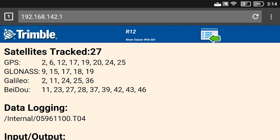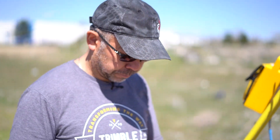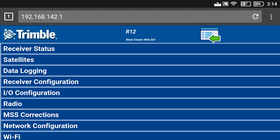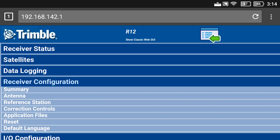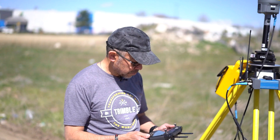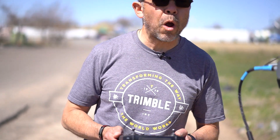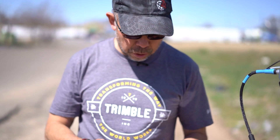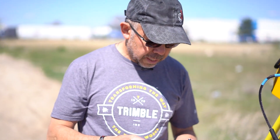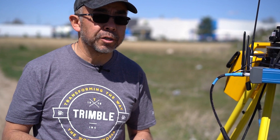You'll click OK and you'll be allowed access to this receiver's web UI, where you can plug in the actual coordinate for this reference station and also make sure that you set up for NTRIP caster. By going into the menu and receiver configuration, then reference station, you can see that there's a position showing for this receiver. We encourage you to use the 'here' button and then modify the last digits to the right of the decimal place to get the actual position in. For today we're just going to use the 'here' position — we're just here to show you that the technology works — but you would actually key in your correct latitude, longitude, and height above ellipsoid. Note that the reference height shown here is not orthometric elevation but height above ellipsoid.